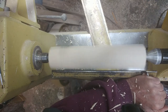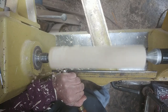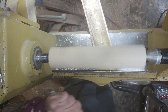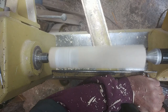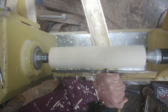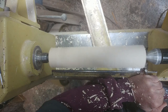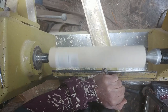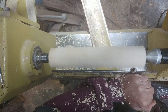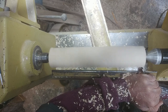As I mentioned in class, I've got three points of contact: my elbow in here, my palm down on the tool rest, and my hand and tool buried into my side. I'm just drawing a straight line across this block of wood. When you're first starting out, you'll learn to draw a straight line across any block of wood that you're trying to turn.